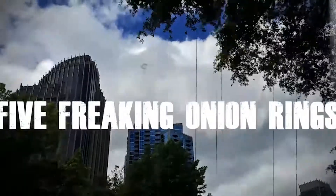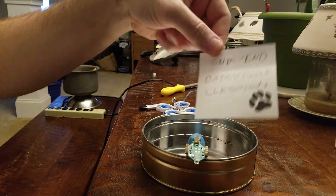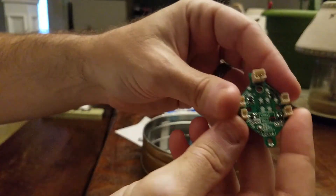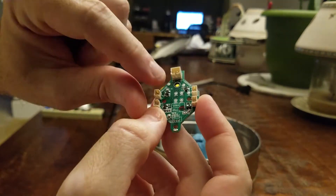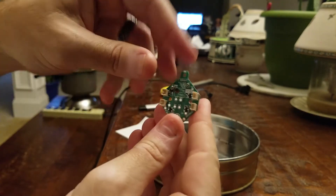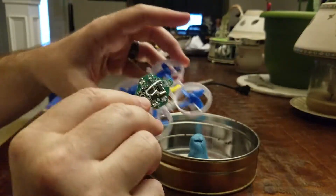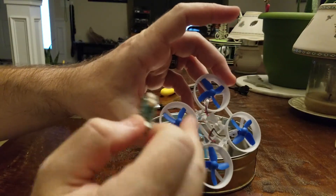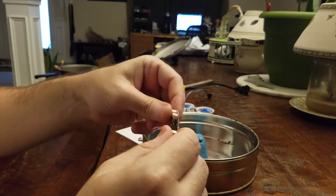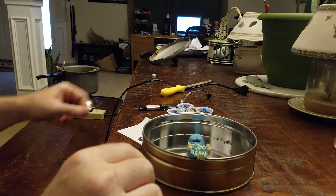On the E11, I've got a little diagram here - my writing's terrible - but basically you have three pads that you have to mount so you can connect your ST-Link. The three pads you need are CLK, DAT, and GND. They're in the center, and when it's mounted they're on the bottom so you can't see them. You have to take it off - it's basically just two screws. The E11 has plug-in connectors, so two screws takes it off.